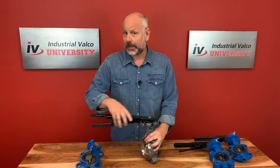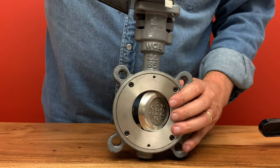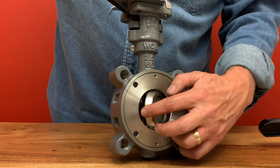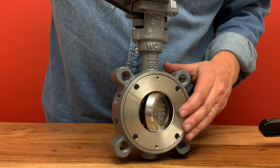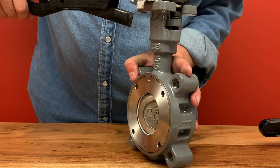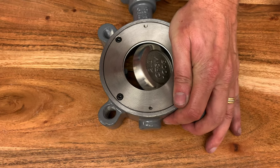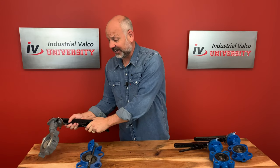You're all caught up on the pros and cons of the butterfly valve, so we have time to look at the high performance butterfly valve, also called the double offset design. The center of rotation is moved from the center line of the valve body. The seat and seal design is conical — like the shape of a cone — and on center. This design relies on elastic deformation of the seat to seal, allowing a larger range of seat materials. The deformation is minimized by the double offset. As the disc opens, it immediately moves away from the seat instead of across the seat. This design has added capability of using line pressure to assist in the seal. There's actually also a triple offset design, but we'll talk about that in a later class.